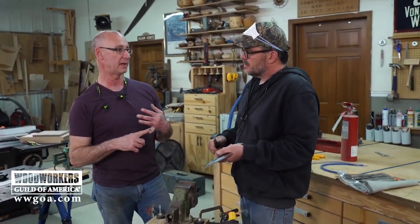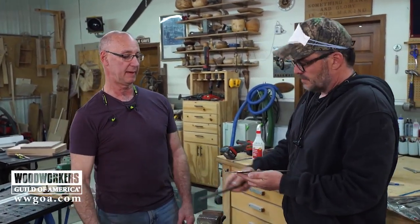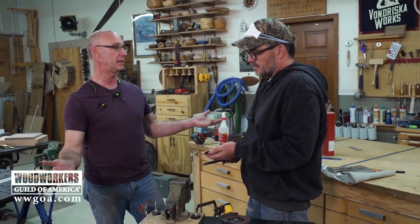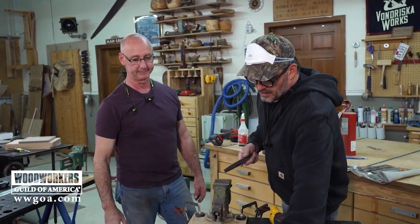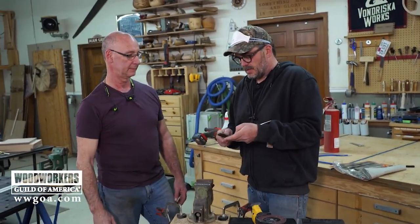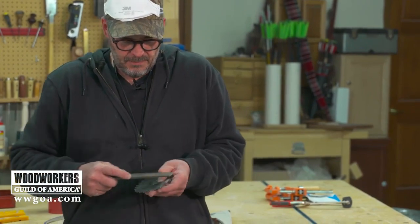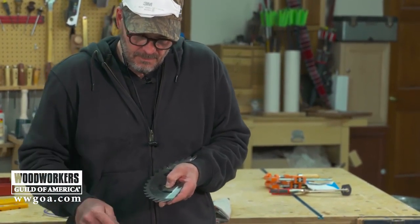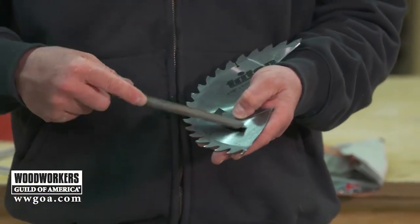In addition to the sparky spark, this is a cool way to get some idea of the metallurgy, because the softer it is, the easier it'll file. Right. Like pine versus hard maple. Like for instance, the hardest piece of metal right around us now is these tips. You can tell the sound difference too. You could hear that grabbing and cutting away. So this is in between those.